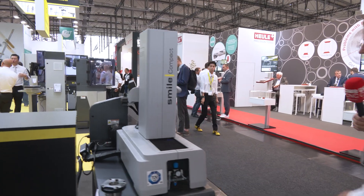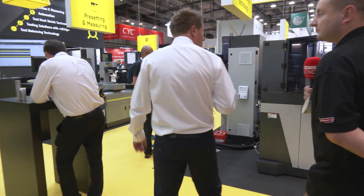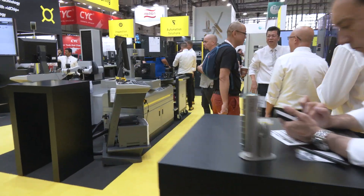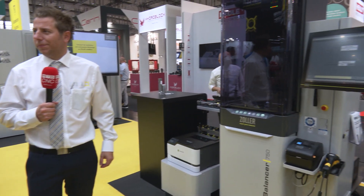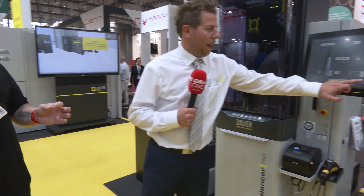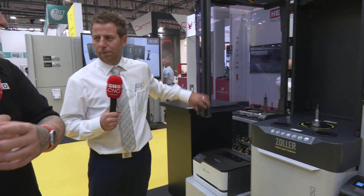What are some of the advantages of balancing? Because not every shop uses a balancing machine. I think there's a big misconception in the industry. Yes, you absolutely should balance for high-speed machining. But also for heavy-cutting tools, you should balance. When you think about it, there's a lot of wear on the spindle. It will increase your tool life, it will increase your spindle life, and it will increase the part finish. The advantages of balancing your tool: you can get better surface finish, your machine's going to last longer, and your speeds and feeds are going to increase as well. With a perfectly balanced tool, you can run faster.